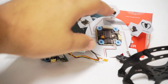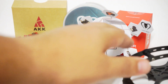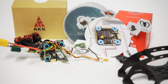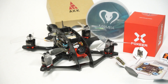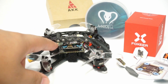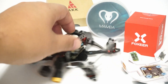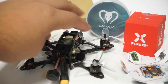There's not enough room on this board for silkscreen labels, so the diagram really is the next best thing and I really liked using it. I wish they didn't put all of the pads you actually need on the left side, because the other side is just for LED and external power — so you're fighting with all these pads on the left side. It works out fine though. I have my capacitor installed and ready to go. Here is the finished build with the Mamba stack inside — look at how snugly it fits. I put the receiver up top for a couple of test flights but there's plenty of room for it between the ESC and FC with a little double-sided tape. I used a Real ACC UX antenna with some shrink wrap, so the video is very clean.